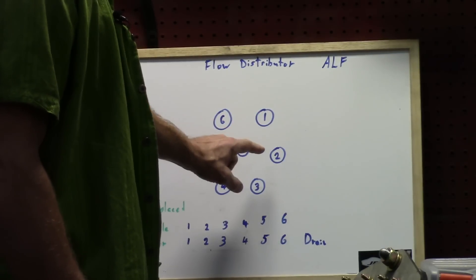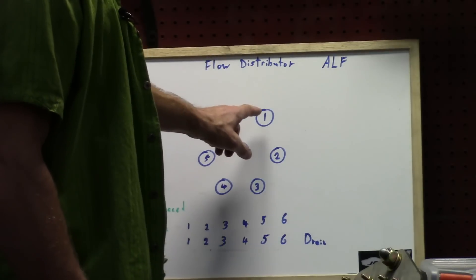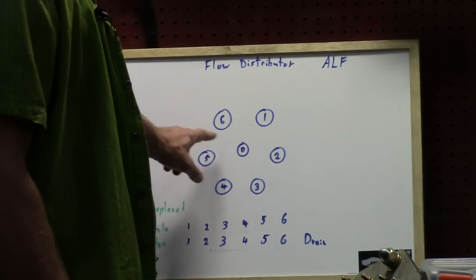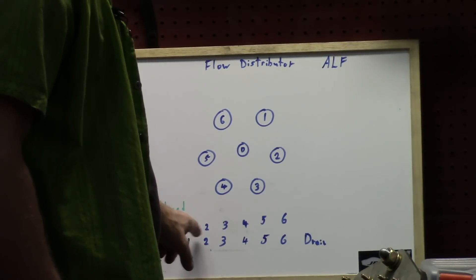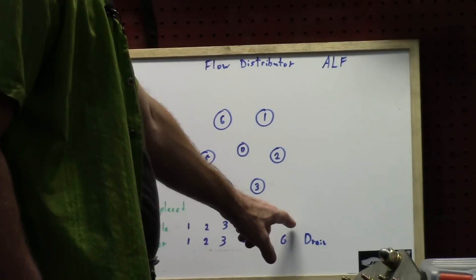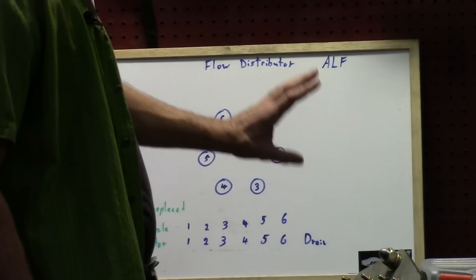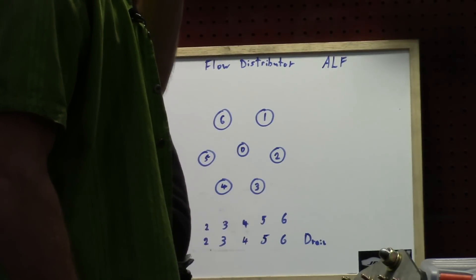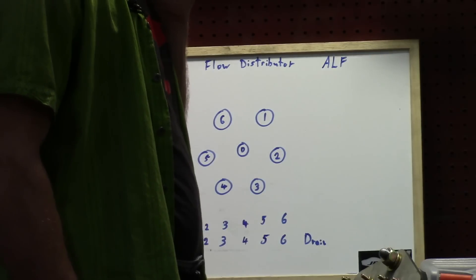This is the pattern of the lines that go to the fuel nozzles — counterclockwise from one to six — and the way the combustion chambers on the engine are arranged as well. I marked off where they were on the flow distributor. There's a drain there, not a zero. So as I replace the O-rings — three per fuel nozzle — I tick off that I did number one, two, three, four, five, six. That's 18 O-rings in the fuel nozzles, plus one for each connection on the flow distributor. I've written that down and taken a photograph of this board so I know absolutely for certain those have been replaced. That's what you want to do in aviation — you don't want to say 'I think I got number five.' You want to know for sure, so you write it down.